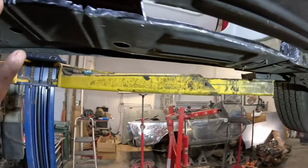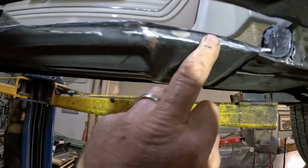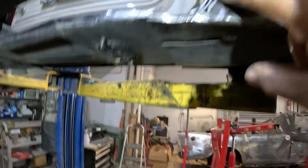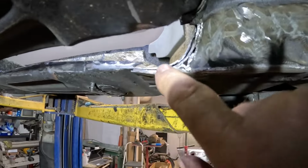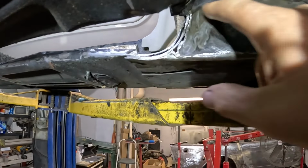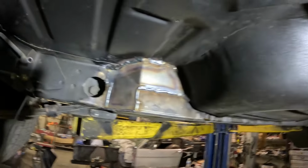Then coming back, this is just the floor, that's the little flange that we've bent up. It will weld into here. We've got like three layers here, so we'll weld this back together. Put the bar up in here, it will weld on around here onto the side of the torque box. Now this side, whoa, that's a bit bright. Okay, this side here is done.